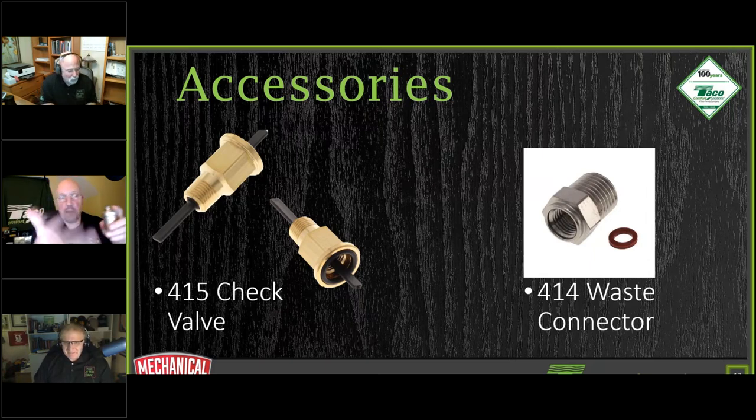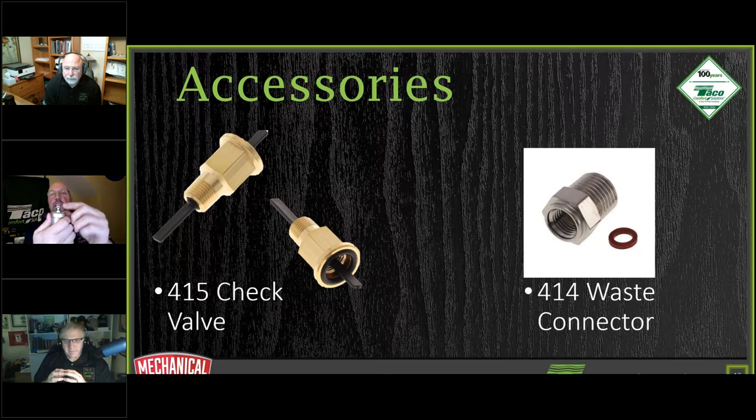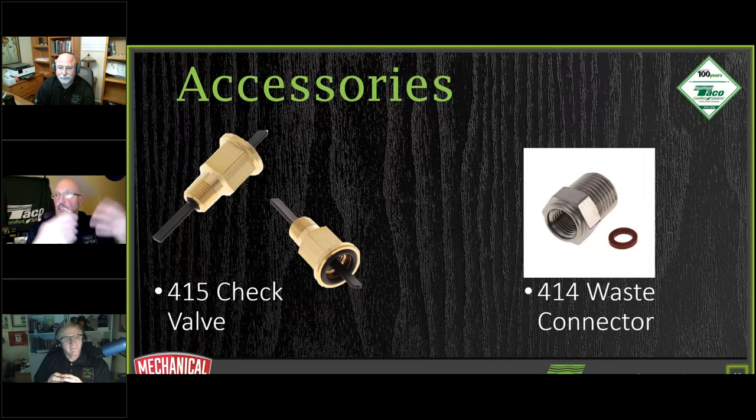So you can go with copper pipe, plastic pipe, whatever you want if you need to convert it over there. Now, when it comes to the cap, what do you do with the cap? You want to leave the cap open. The cap has a couple of slits on either side. You put it down tight, and there is an O-ring seal on the inside, so you can tighten them down. And then you give it one turn open. You don't want it to be wide open. Give it one turn open, so this way it will let that air out.